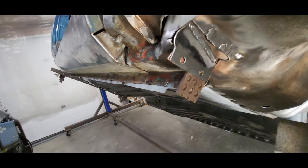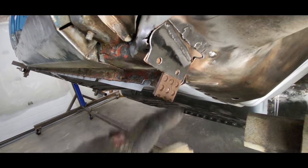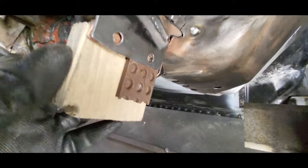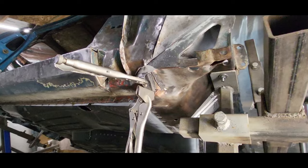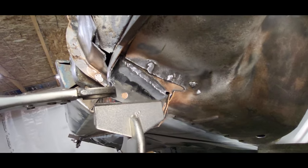Getting this baby drilled out — a little pro tip for you: whenever you're drilling on metal that's close like this and you want to hold it from the back side for maximum leverage, use a block of wood, because if that drill slips off there you're gonna lose some skin. Got it clamped up there and ready to be welded up. Let's get to it.